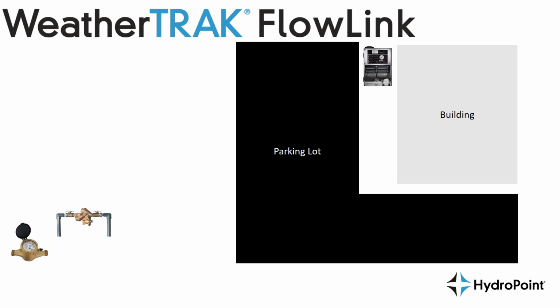That's where the FlowLink comes in. What the FlowLink is going to do is use the wires on those existing field stations and pick those up where they leave off at the valve. Then you'll just have to install your new flow sensor and trench from where the existing valve wire stops over to where you want to install your flow sensor and master valve. And by eliminating trenching across the parking lot, we can significantly reduce the installation cost of the flow sensor.